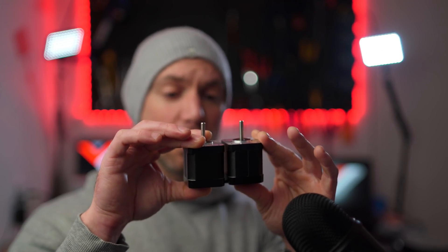You've probably heard of this guy before. It is the LDO Speedy Motor, and it's called the Speedy Motor for one good reason — this motor is speedy and it's really awesome. This is what I've been running on my printer for quite a while now, and this is the main reason why I switched from servo motors to stepper motors. Couple that with 48 volts and you're getting crazy acceleration, speed, and performance. But I also wanted to test this new guy — the LDO, same size, 48mm long, except this one is 0.9 degree and this one was 1.8 degree.